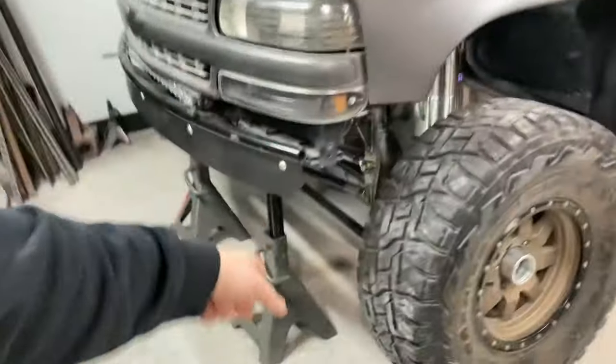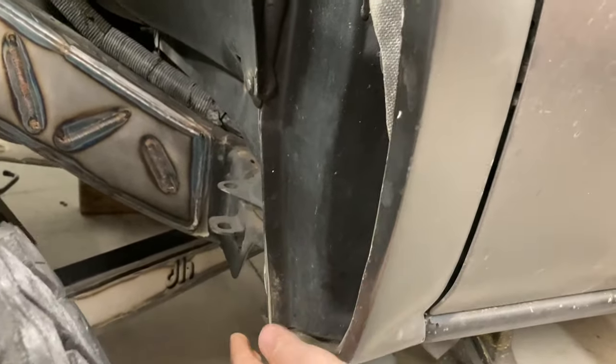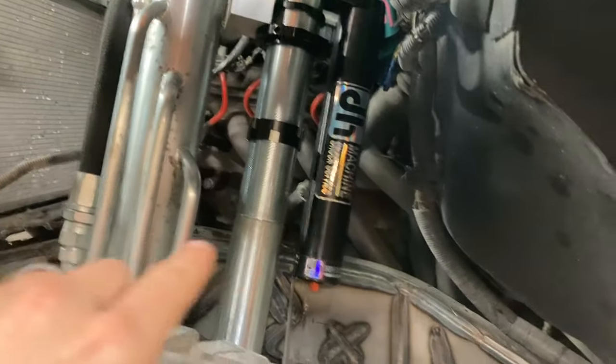I talked in the last video about a bunch of stuff that we were going to be doing, and that's what this video is now. Shocks, bumps, probably limit straps, finishing up the steering, getting a gearbox on there. And before I do any of that, what I'm going to get started on first is coming in here and trimming up this rear, so that when I cycle this tire up in here, we're looking for more bump travel.